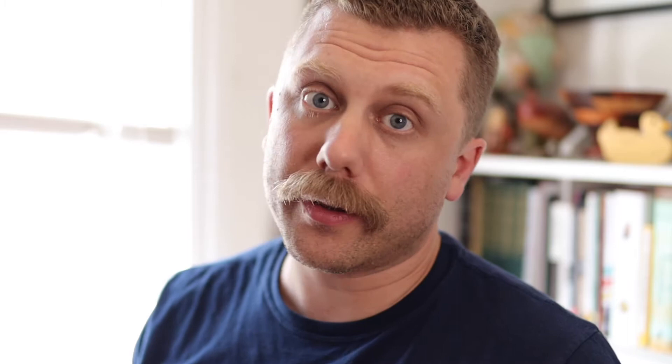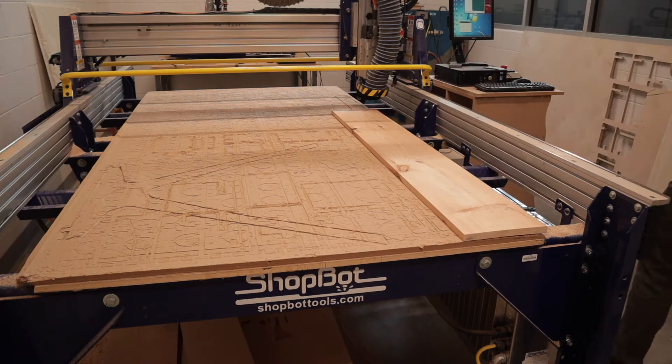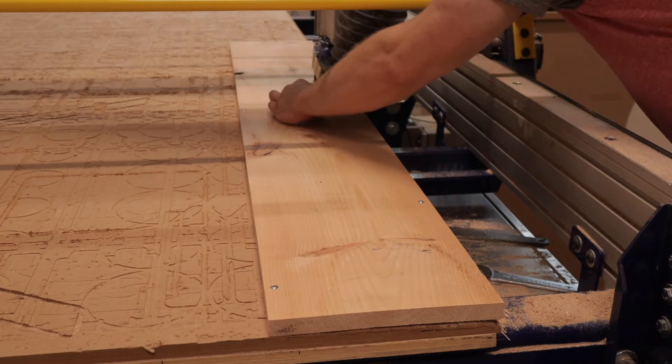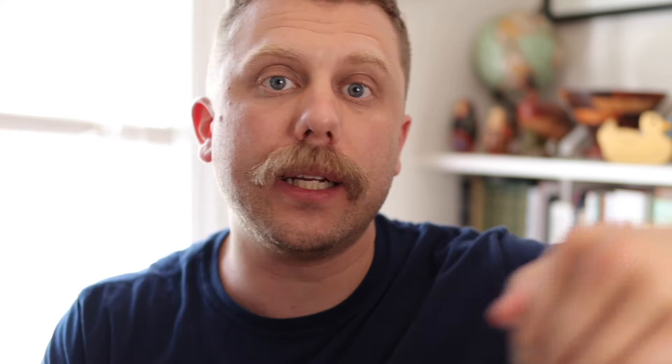I came to find out that the top part of the sign was actually made of foam, and the address piece with the 19A, that one is actually made of wood. Whenever you're trying to do a long piece like that, it's so critical that the piece of wood, when it's secured to the table, follows perfectly where the router would go in the X axis. To ensure that it followed perfectly, I screwed a scrap piece of wood down to the bed of the table and cut a pocket out on that board so that I could hammer in a little support piece at the bottom to press it tight against, knowing that it is a perfect straight line even with the X axis of the machine.